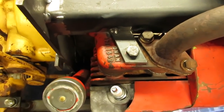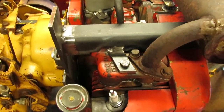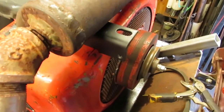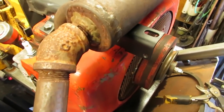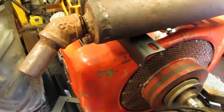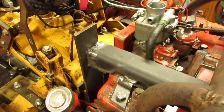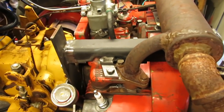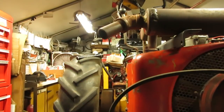The little bracket is tacked onto the side — I bolted it down, threw a piece of leather over the engine, and tacked it on quick. That got most of the side-to-side and up-and-down motion out. There's still a little twisting motion as expected with angle iron. I'm going to start building the bracket that extends out the side for the hydraulic pump and see how everything moves. I might be able to gusset the backside of the angle iron to reduce some of the twist. I'm not welding everything completely yet so I can cut things apart to adjust if needed.